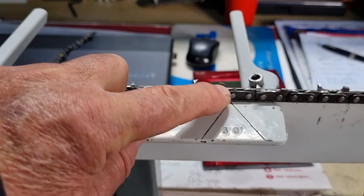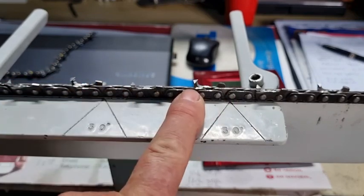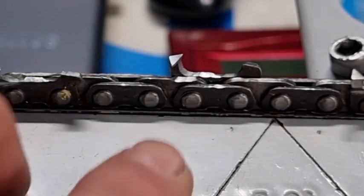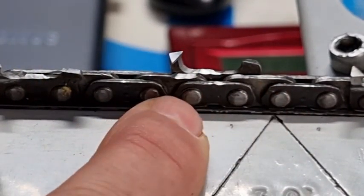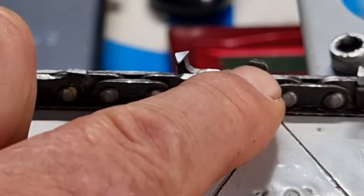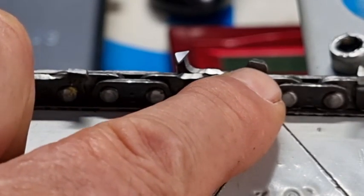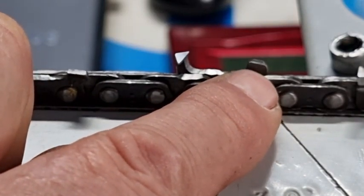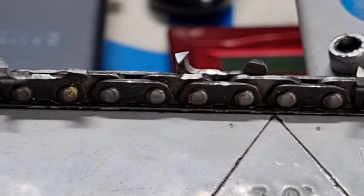So there's actually quite a big distance now from the raker to the tooth, approximately 14 millimeters. So this distance has increased dramatically. The rocking motion is very sensitive now. Therefore, to work efficiently cutting timber, you have to increase the cutting depth. So the raker must be lowered. The difference is almost double. It's about 1.2 millimeters by the time you get down to the end of the life.